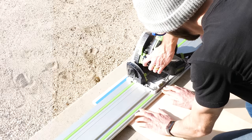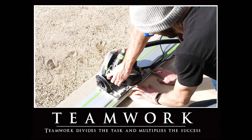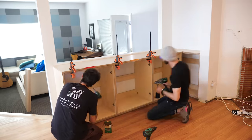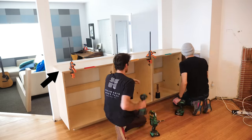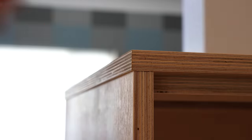This corner is a slightly acute angle, so we had to trim a bit off the back edge at a taper to get the best fit possible. You can see both corners lined up nicely, but the wall is concave so there's a gap in the middle — you could scribe a line and cut a gentle arc on the back, but I'm going to use simple moldings covered in the living room renovation video. We then attached the top to the cabinets and used a router with a flush trim bit to trim the end that we'd left long, with some additional sanding and wipe-on poly needed after.